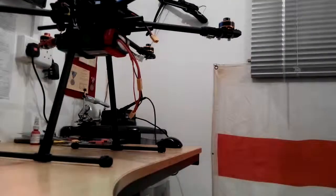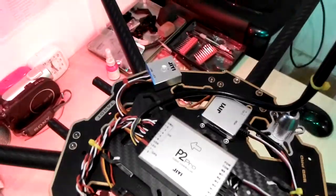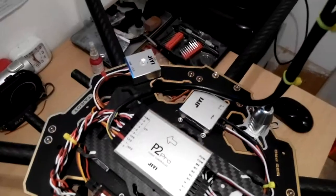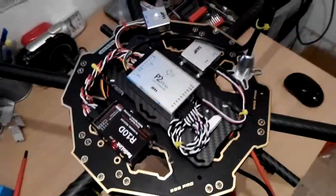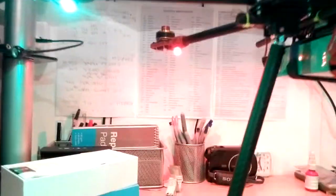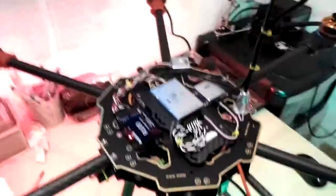Give that a minute - it's showing two blinks on the flight controller, which means it's booting up. There it is, already on one blink, which means we do have GPS lock. How many satellites I have I do not know, but it says there it has GPS lock, so that's the main thing. We're all hooked up and the lights are all working as well.